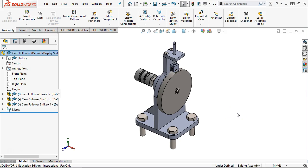Now, really, there's all these things running in the background that we kind of take for granted, that are instilled as part of the build process, as the designer or the manufacturer, of what those clearances, allowances, interferences mean. But when you get into the H values, the whole hole basis, shaft basis, that really is another conversation. So I don't want to take it that far, but I am interested in applying it, because that seems to be something that is like cultural knowledge or industry knowledge, but doesn't really get explicitly stated. So find a better way to state it, and we'll bring it into the mix.